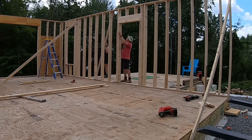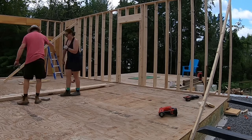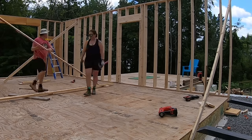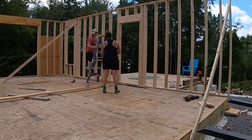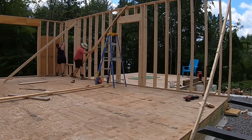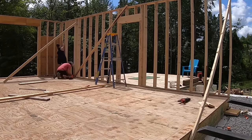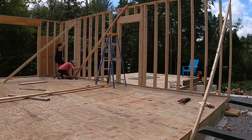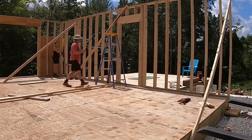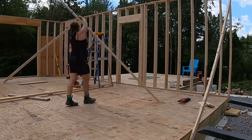We took the temporary bracing off the outside as that will get covered with zip sheathing as it is considered an outside wall. The top of the wall had to push out, and I quickly realized that I put the brace up the wrong way. Instead of pulling from the bottom, it is easier to put the brace on the other way and push instead.